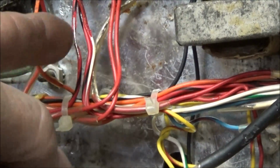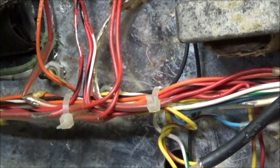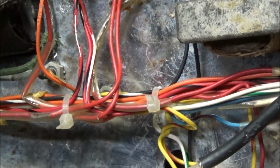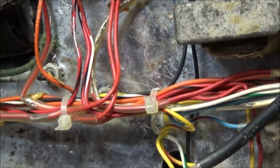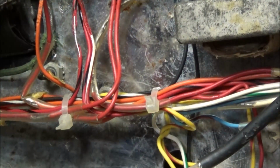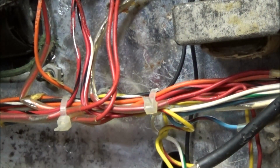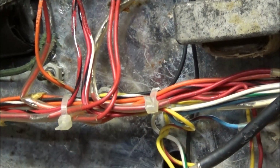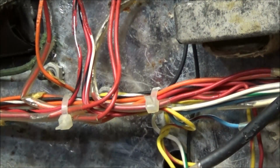You can see right there what's been gnawed off. So be real careful messing with this kind of stuff, because yes, it's 110 volts, but we have 300 or 400 volts from the transformers, and if you come across this, you're going to have a bad day. So just be careful. Don't just go by someone saying in the listing that they plugged it up and it powers up, untested. Be skeptical. Don't go yanking the cord in an outlet, because you might find out that your transformer goes up in smoke.